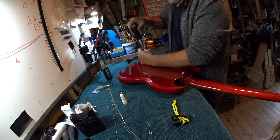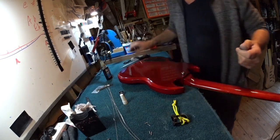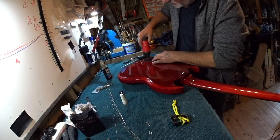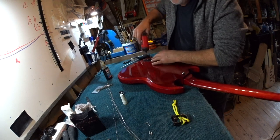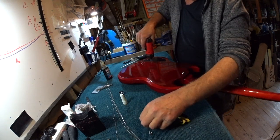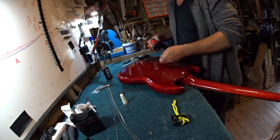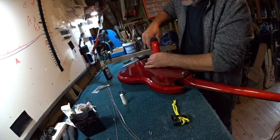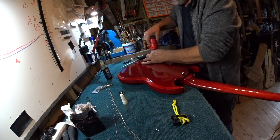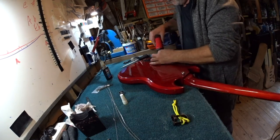That's a fundamental thing, because that would have seriously messed up live playing, for example, because you wouldn't know. It's not immediately apparent, but the movement was causing, in the short term, it to ground out against the tone pot, causing a drop out in tone. And then longer term it would have snapped off the solder, and then it would have stopped working. Probably at the least opportune moment. Okie dokie, right,